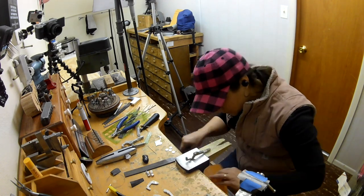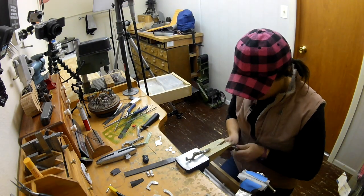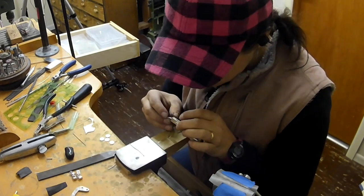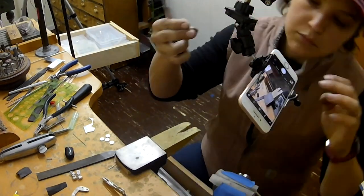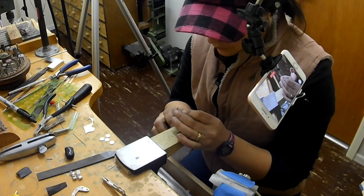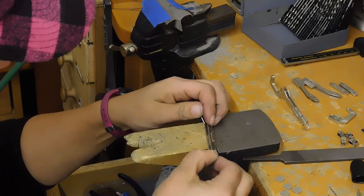I figured out that the cavity the tube has to get soldered into was actually too wide for the tube. At the beginning it was not wide enough, but now it's too wide and I'm afraid it's not going to be in the center. So I'm designing these little tiny 20-gauge round wire clips out of sterling silver — it kind of looks like the metal part of a binder clip, but I just needed the springiness. I'll show a close-up in a second — this was literally unexpected.